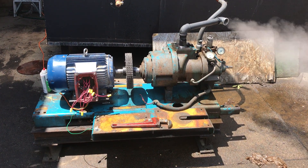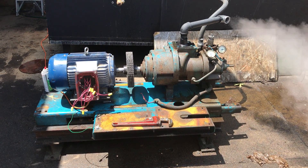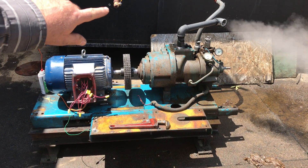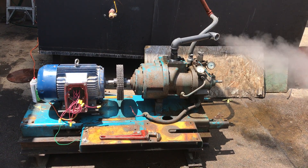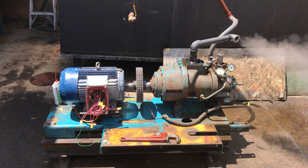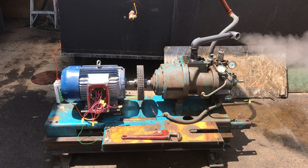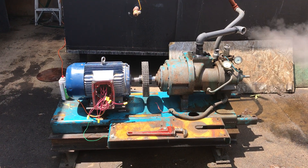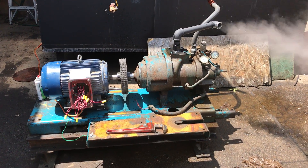This is an oil-less system and will allow us to recycle the steam without contamination. We'll have more videos going forward, but we're happy with this performance currently. Very efficient machine so far. We've got a lot of condensate actually — since this is overexpanded, we've already condensed a large portion of the steam in the process. Really quite happy with the performance here. Nice, quiet unit compared to some of the streamers.